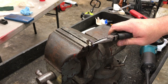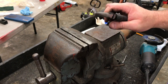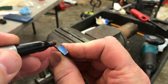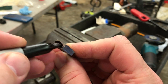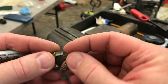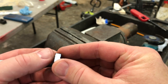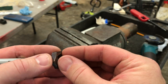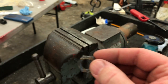Alright guys, we've got the sides cut off of it now — still looks kind of rough. Now we've got to get serious about grinding the sides and getting them nice and flat. I want to go ahead and mark the top of the ring here and color that so I don't get it mixed up — this is the thickest part of it. Hopefully there's enough room up there to get her initials engraved on the top when we're done. This side here is the thinnest, and what we're going to do is try to get all this squared up, shaped from this thickness all the way down to this thickness and possibly even thinner. First we're going to straighten up the center of this hole before we start flattening the sides.